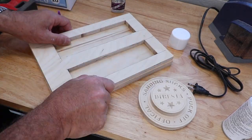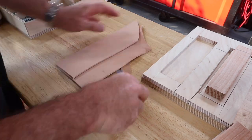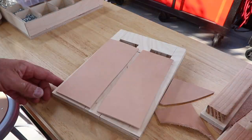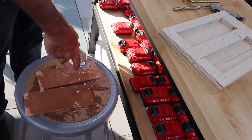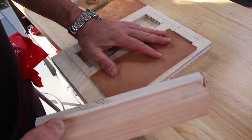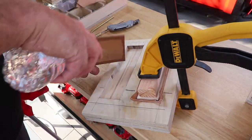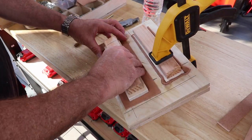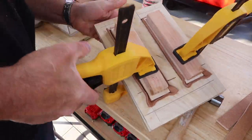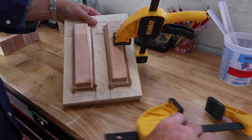Just a little activator. Now this is going to become garbage shortly after. Just two pieces of leather and I'm going to wet them real good. I'm marking a little bit more than I need because I'm going to wet that leather and push it into those voids backed up with the wood plugs. Now I'm just wetting that real good - I just wet it for probably five minutes. Now I push that plug in there with a squeeze clamp, my favorite kind. I can't stand soft trigger clamps - I find them to be completely useless. I left room between the plug and the mold to accept the width of the leather. I did a test off camera with a small piece to see if it was going to be enough.